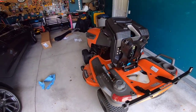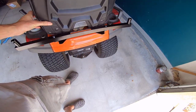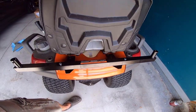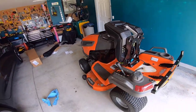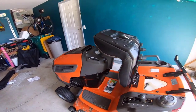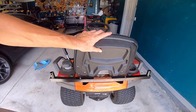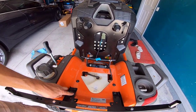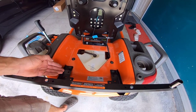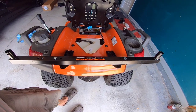The first issue I'm running into: I have it mounted on these two back screws like the instructions say, but the problem is when you put the seat down, it's actually sitting on this bar instead of fully getting down onto the deck of the mower like it's supposed to. When I saw this canopy at Lowe's, it was installed on a Husqvarna tractor, but not a TS series tractor, which is a little higher end. One of the things they change with the TS series is the seat design. So I'm thinking my solution may be to move this back and just drill a couple of holes in this platform — not ideal, but let me see how feasible that is.